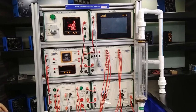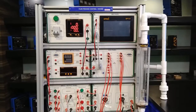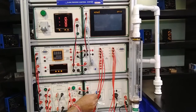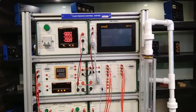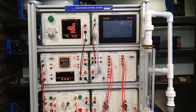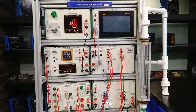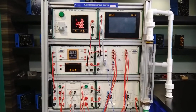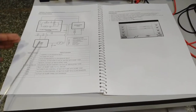Now we will connect the sensor connections. We will use both the turbine flow sensor and the electromagnetic flow sensor — connections will be done and then we change the valve connections as per the requirement for each study. We will connect the turbine flow sensor terminal T5 (sensor 1) with T23 of the DAQ panel — this is the analog input. T17 from the electromagnetic sensor output will be connected with AI0 (T15) of the DAQ module. These are the complete connections. Now we will follow the procedure to operate the valves.